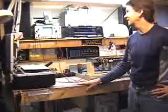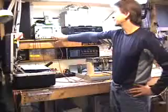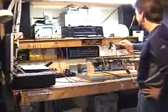it starts clipping. Alright? And I'm going to measure it two different ways. One, I'm going to use a voltmeter, and I've also got an oscilloscope connected because the oscilloscope lets me monitor the sine wave that we're going to be looking at, and also lets me do some more accurate voltage measurements if I want to double check everything.